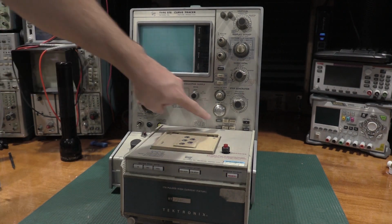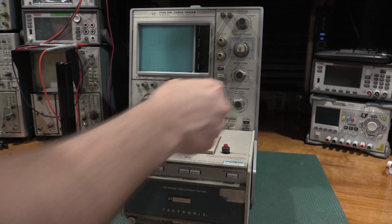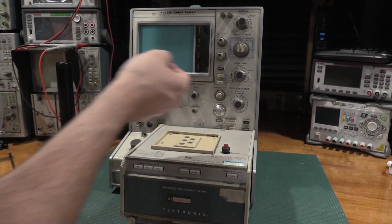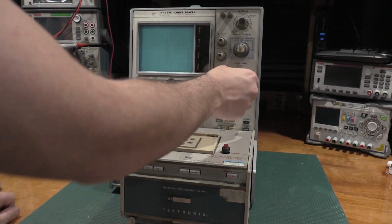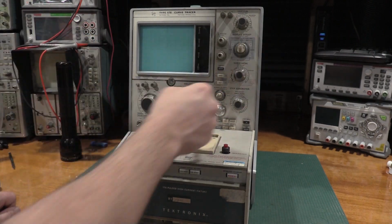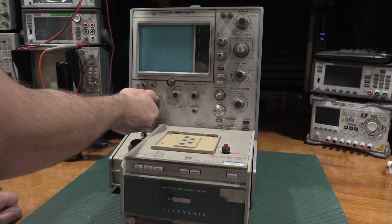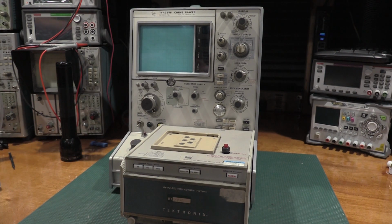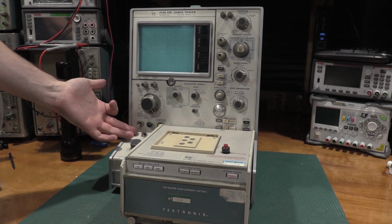Now, to operate the test fixture, 300 microsecond pulses need to be set. Now, step generator, gonna give it a bit. Number of steps 1 is fine. Vertical, give it about an amp per division. 1 volt. 15 is okay. Alright, it's not on the current limited supply, but I do have it current monitoring, so if anything goes catastrophically wrong, we'll watch it.